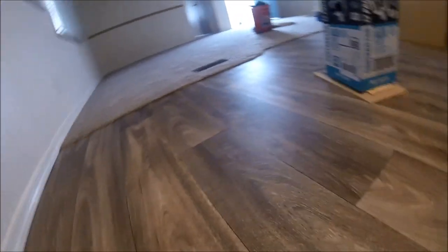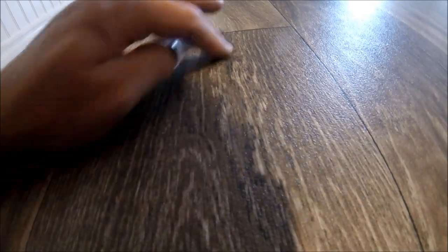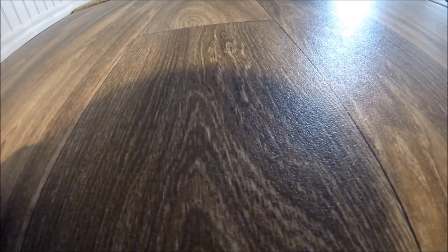As you can see, the weight's been off of it for a minute now and it still looks good. If you have any problems getting bubbles out, or if you have a bubble in your vinyl job when you're done, that's how you take care of it without folding it back out of the glue or anything like that. You cannot see it anywhere — I don't even know where it was now. Somewhere in this vicinity, it was just a little bit past this line where I stuck the needle in. And because that is a seam sealer, when I pulled my needle out, glue squeezed back out of that hole — as you've seen how it squeezed out both ends. Because the seam sealer squeezed out the hole, it sealed that little bitty hole back up where the needle went in, so you'll never have to worry about that little pin hole collecting dirt — if you're working with a white vinyl it's going to be sealed back up from the sealer as it squeezes out.